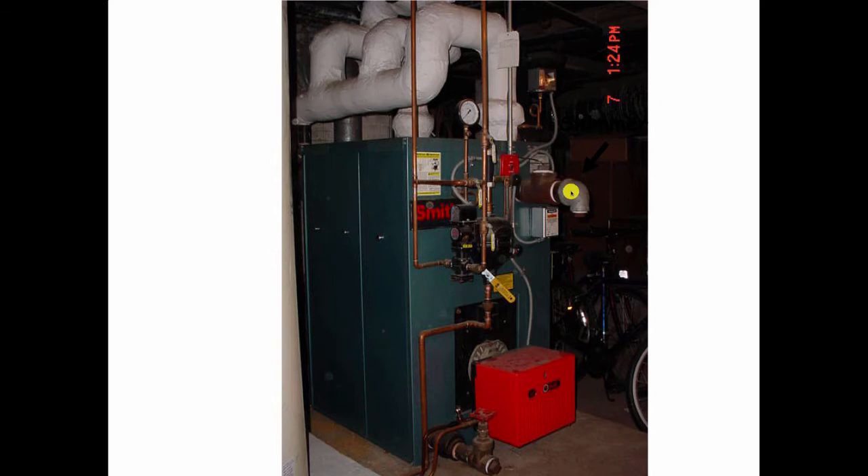The reason you see a T here is because my buddy who did this job knows that if he uses a T, he can fire the boiler for a day or two, then shut off the burner, let cold water trickle in, and pull the plug out of that T to see where the water level is. Without that T, you really can't tell where the water level is, and you're liable to be skimming from where the oil ain't.